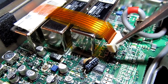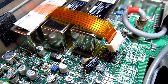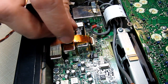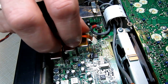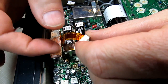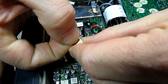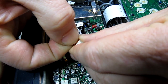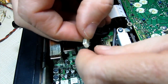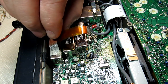In the meantime, we can take care of reattaching this connector back to the circuit board. The first thing we'll do is pull the ribbon cable, or the flex circuit, out of the connector here. We can do that by grabbing the edges carefully and rocking them back and forth ever so slightly to loosen it and pop it out. This is the connector we need to reinstall back on the board, so we'll put that off to the side and pull this ribbon cable up out of the way.